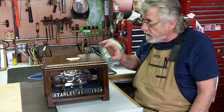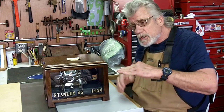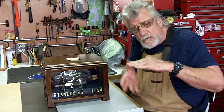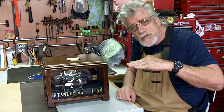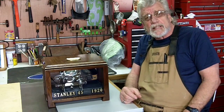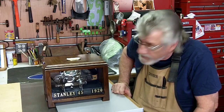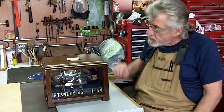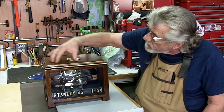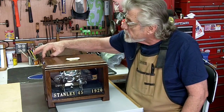I made a few mistakes that when I had to redo them, the groove or the dado was just a quarter of an inch. So instead of putting the dado back on my table saw, I just nipped it off with the table saw. But unfortunately, my blade is kind of an all-purpose, and it cuts kind of a V. So when I put it in there, it didn't look all that good. Some of my joints are real nice and tight. Some of them aren't.